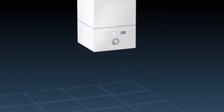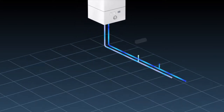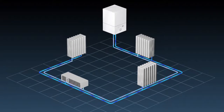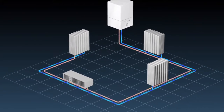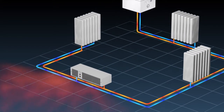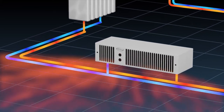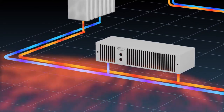The really clever bit is that it's got a sensor, so it won't blast out cold air. It actually waits until the water coming through the heater is warm enough, and then it automatically switches on. You can just leave this thing on standby all the time — whenever the heating system comes on, this will kick into action. And of course if you're doing a lot of cooking and you want it off, it's a simple flick of a switch.